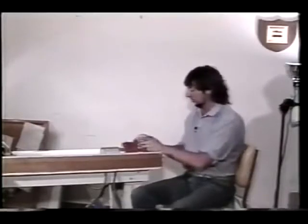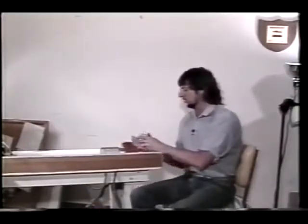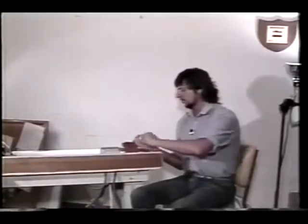Now, the object of this is not to unlock the lock, obviously. What this tool should do is grab the inside cylinder and yank it out, which of course would let us open the lock with a screwdriver if it works. Once it's in, we turn it another quarter turn until we reach resistance. At this point, we grab the back of the bolt and turn it.